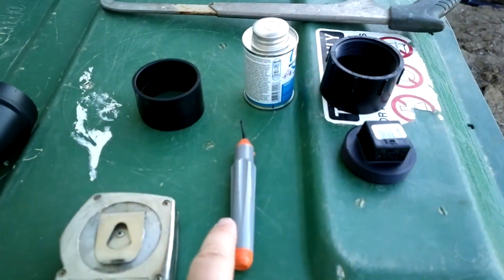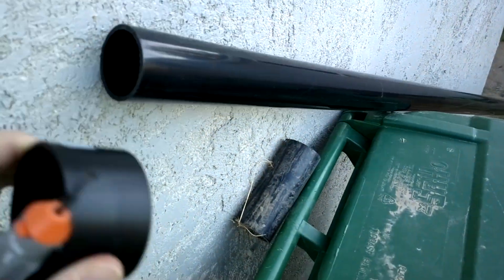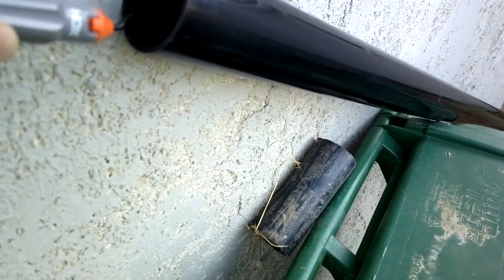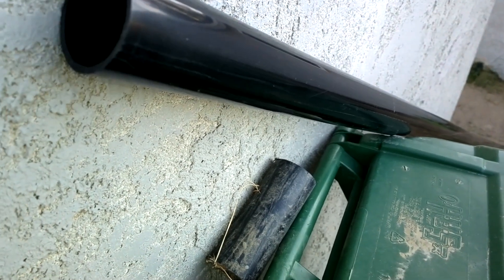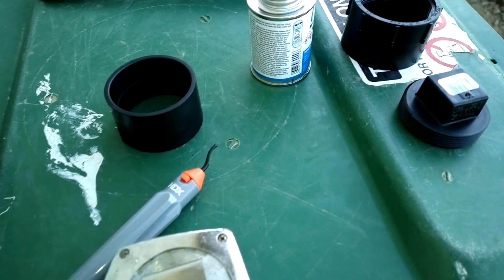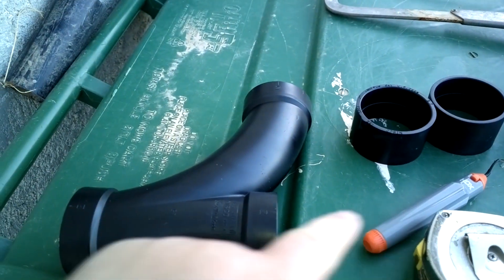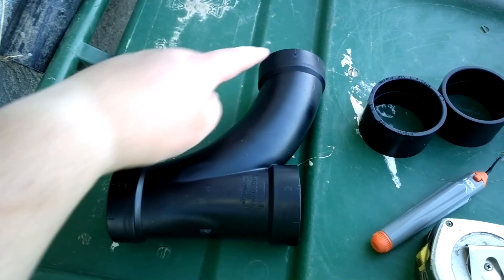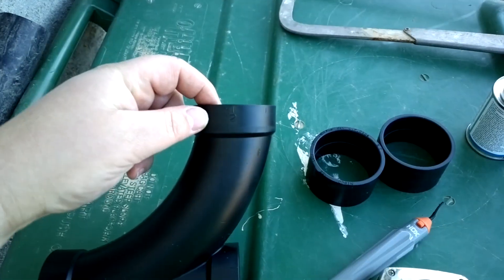The secret here — we'll also need this, a pipe reamer. This will ream the older pipe cut off over there. It will ream around the big one too — run it around here, get some of that action. You really want to get the sharp edges off. You can get the outside a little bit too — I like to get the edges off to make sure it's smooth when it goes into something like this. And we have two of these couplers — the T, or the Y I guess you should say. The way this installs is: if your water's flowing this way, that's the way you install it. If you're going to snake a drain or need an inspection camera, you'll be able to open up this top part, put the snake down in it, and it'll go all the way down that part of the line to check for roots or whatever. Also got a hacksaw — I was going to use an electric saw but I forgot it, so I'll try this hacksaw. I just need to cut through a two-inch pipe.